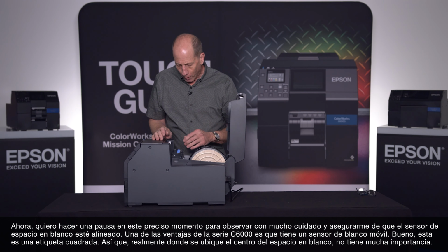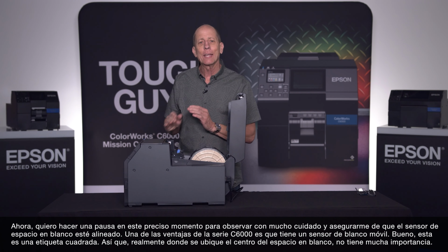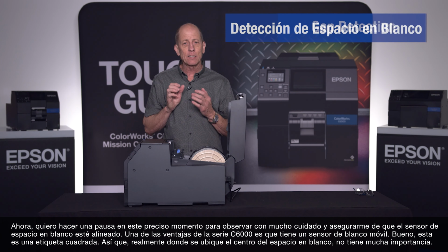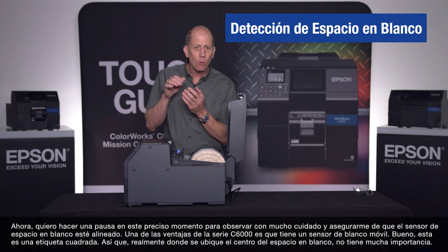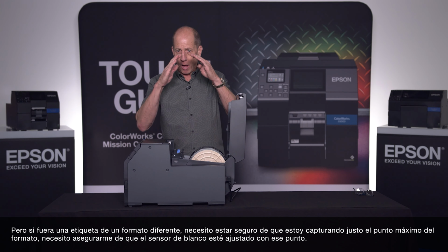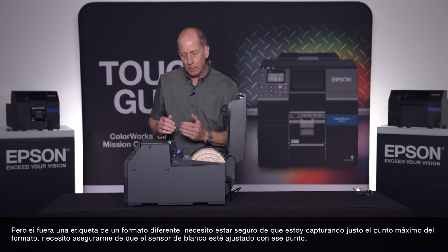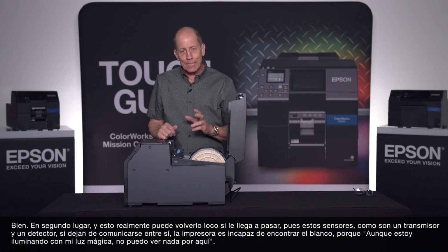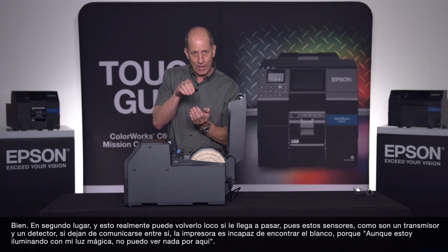Now, what I want to do is I'm going to have a step here where I will have to watch very carefully to make sure that my gap sensor is aligned. One of the advantages of the C6000 series is it has a movable gap sensor, okay? This just happens to be a square label, so it doesn't really matter where the gap sensor goes, but if I had a label that maybe had an odd shape and I need to make sure that I'm capturing right at the crest of that shape, I need to make sure that that gap sensor is adjusted at that point, okay?